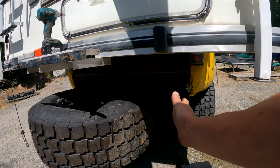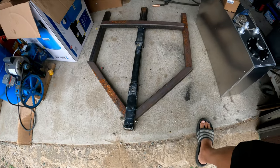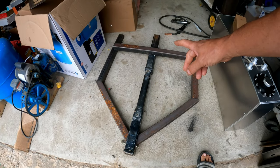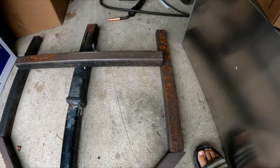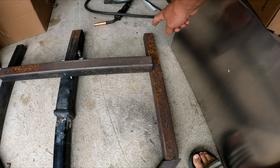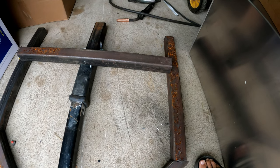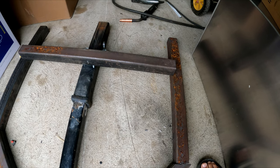I can put my other tubing under the outside edge of the frame and then plate it down for support. I'm just roughing in the pieces for my spare tire carrier design and hitch extension. This is the hitch extension I had on the truck when I took my measurements. I built this crosser that I've tacked in place — made sure it was nice and straight. These pieces are going to fit into receivers that stick past the back support. My concern is that it all needs to be built as one piece and they have to be perfectly straight to each other, so I do have concerns about it not sliding in and out well.